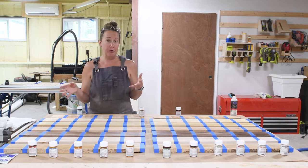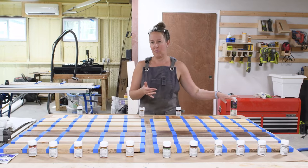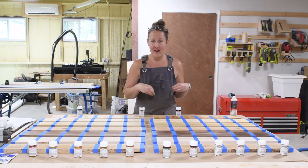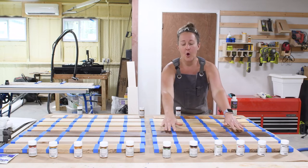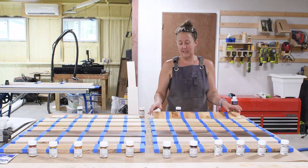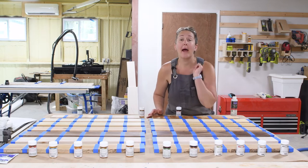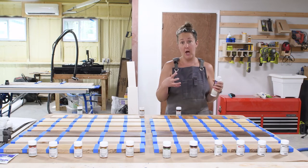How many coats of sealer do you apply? With the UTOS, it really just depends on the species of wood. Anything softer than oak, you're going to want to apply two coats of your UTOS. So for me, I'm going walnut, alder, poplar, pine, and this scrap of birch countertop — those are all going to get two coats. For my hard maple and my white oak, I'm only going to do one coat of the UTOS because those harder woods will not absorb as much.